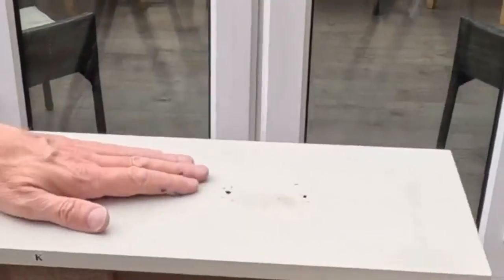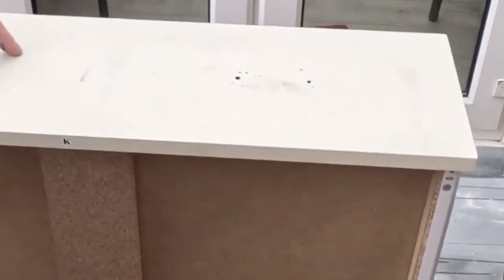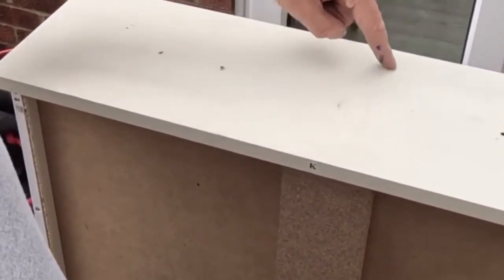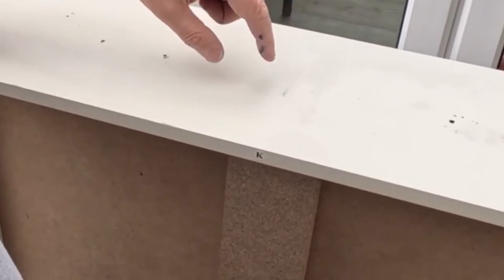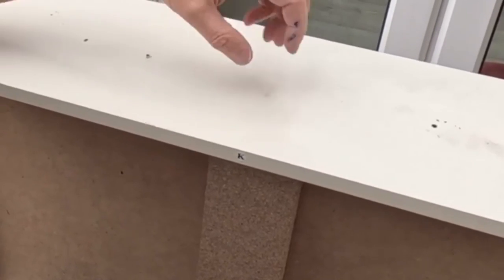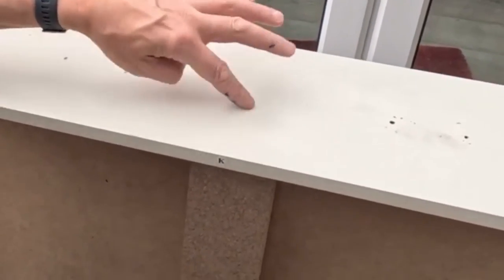I think it's a nice olive — see if she likes it when she gets home from Malaysia. So taking the handles off, I'm going to carve outset letters saying 'Helen's Drawers' with a shape on the outside. There'll be outset letters with a 90-degree V-groove, just carving out the background like I did with Emma's sign — watch out, you'll see what I mean.